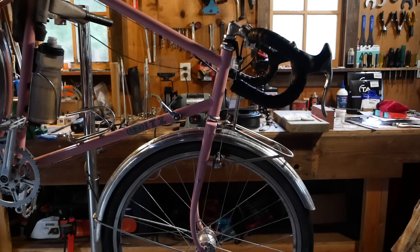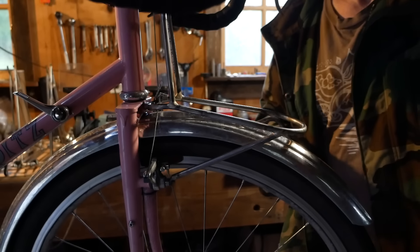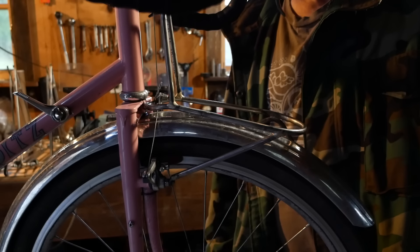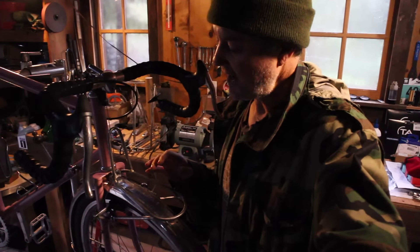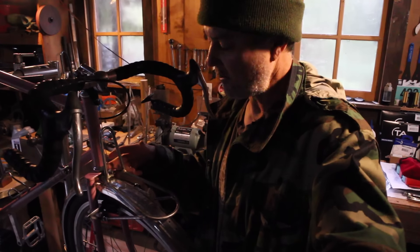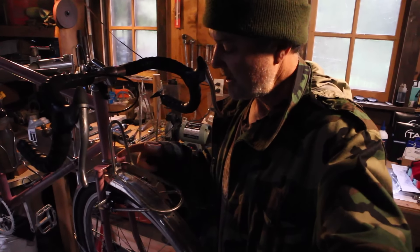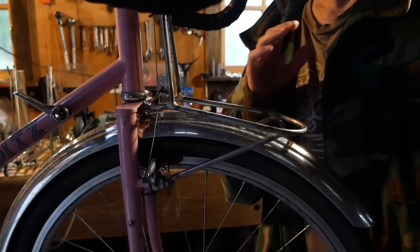After I left the shop with John a few days ago, I took Ms. Cools out for a bike ride to test out the rack. I wanted to make sure the cable system passing through the rack would not be a problem - because once you're out on the road, that's when you really discover when things go wrong. It turns out there was a slight issue: the brakes worked fine, but because of how close the rack was to the crossover straddle - the yoke - there was vibration. It was too close and rubbing, rattling enough to be noticeable.